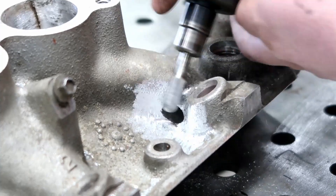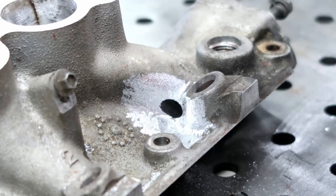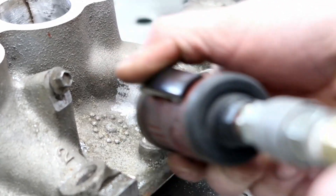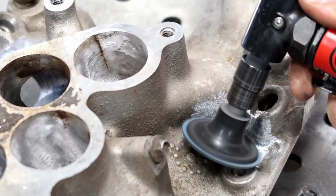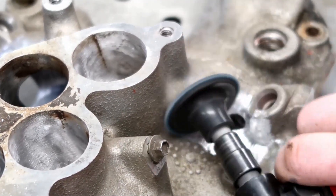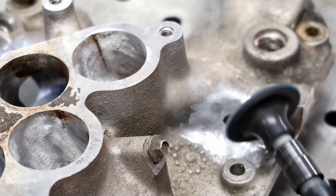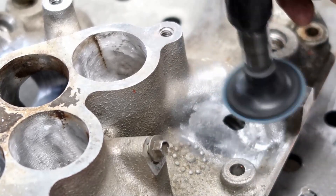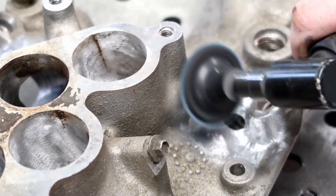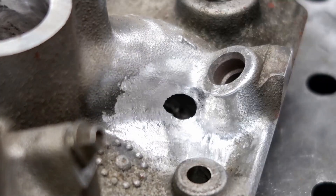This is not the ideal bit for cleaning aluminum — your ideal bit would only have three or four flutes and be less prone to gumming up, but this is what I had. I'll leave a link in the description to a better carbide. Next we're going to move on to the blue scotch-brite pad. Not everybody does this step — it's going the extra mile and polishing out the surface, because with cast aluminum you still have to deal with impurities embedded in the metal from the original casting. Once I'm content with the scotch-brite job I get in there with a little acetone and a rag to make sure there are no surface oils from either of the prior two processes.